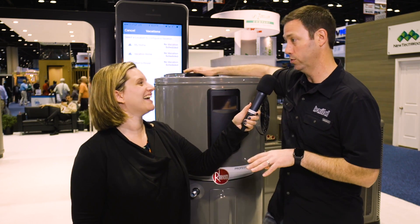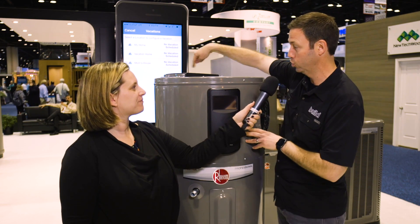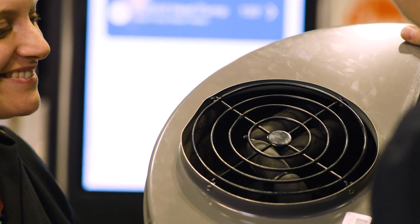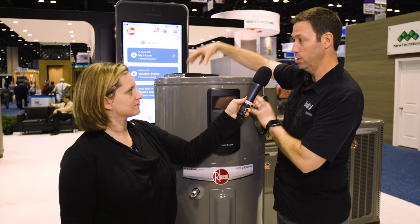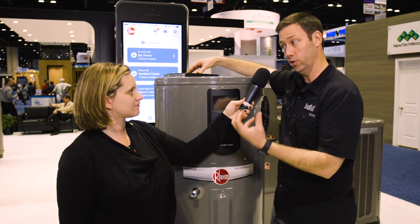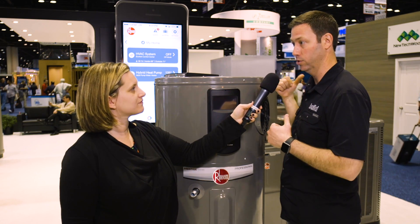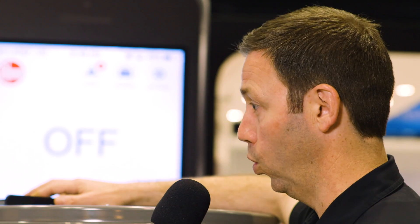I can't contain myself — this is the coolest feature that I've been asking for. Only one other manufacturer had it and they're out of business, so as far as I know, Rheem's the only one that has this. See these two ports right here? This means now we can duct in and duct out of this unit. This is not meant to be an air conditioner, but for southern builders like me in a cooling-dominated climate — hot and humid — this is a really big deal. I can put this unit inside my conditioned space, in a closet. I can bring a 7 or 8-inch duct, pull air from the hallway, put that air into the unit, and the heat pump is going to take the heat out of that air and dump it in the tank. It's also going to drop some humidity, because this heat pump is basically like a mini air conditioner. The byproduct on the other side pushing out into the house is cold, dehumidified air — this little heat pump is pumping about 4,500 BTUs of cold, dehumidified air out.